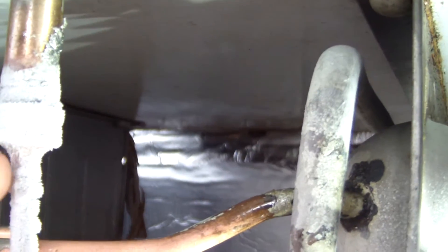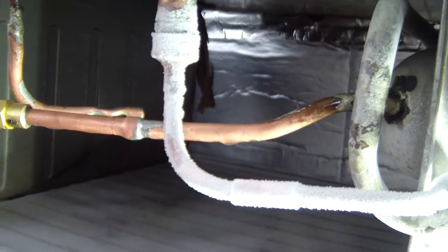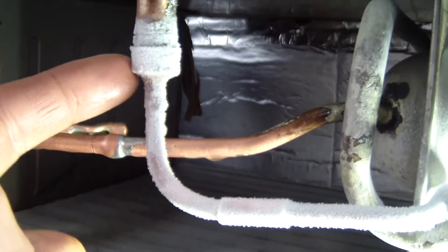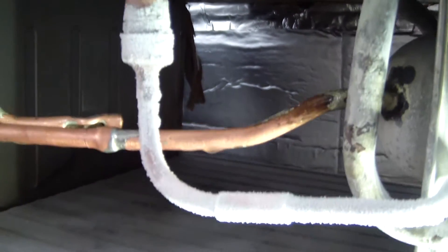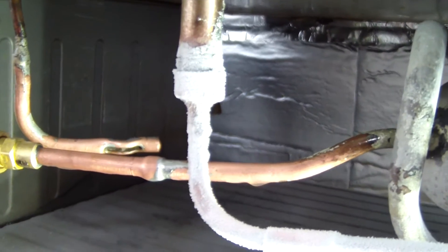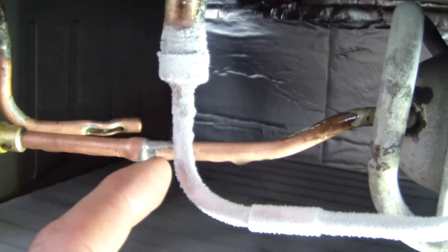This thing was broken right here, so it was going to be a very difficult thing to repair. I can do metal spinning, so I made a little metal-spun adapter out of copper — actually just half-inch copper pipe. But half-inch copper pipe isn't half-inch, even on the inside — it's a little bigger. So I had to spin it down to half-inch and then spin it down to 3/16 for this tube.